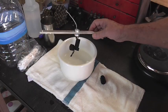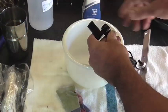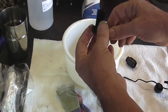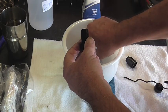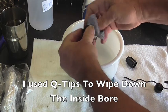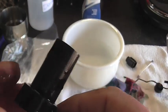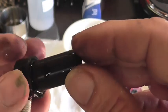Here's our part fresh out of the sealer. More distilled water rinse. Sometimes the parts will have a chalky appearance — it's no big deal. All you do is wet a cloth and give it a good wipe down. And here we've got a midnight black aluminum part.